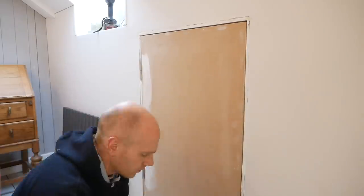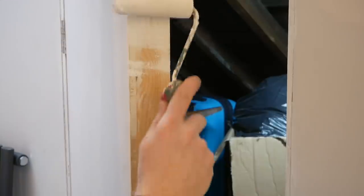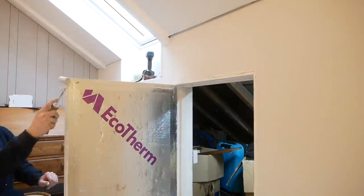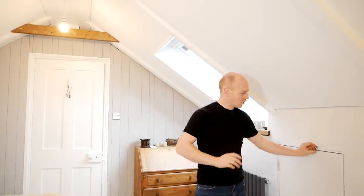Then it's time to jump straight into a quick undercoat and primer to get that ready for painting. I'm not going to make them look like doors — I'm just aiming to paint them with the same light grey emulsion as the walls. So really simple, just give it a bit of a rub back and then go straight on with that, using a normal emulsion-type roller to get the same finish on both parts of the wall. Okay, so we've jumped ahead a couple of weeks now and it's done — all three of them are complete. The only exception is I've still got to trim out a little bit around the outside, but it's such an improvement compared to what we had before, which was just insulation wedged in there.